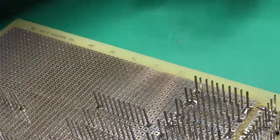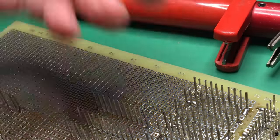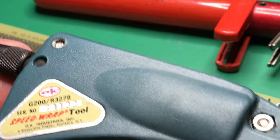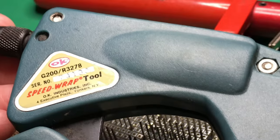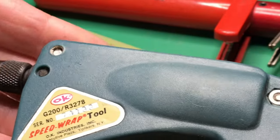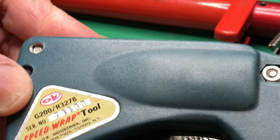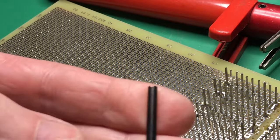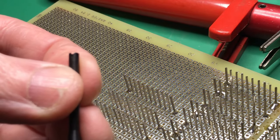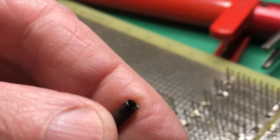There are various other types of tools used in mass production as well. This is the simplest one and the cheapest one. This is probably the next commonest. This is a semi-automatic hand tool. It's a bit like a Yankee screwdriver, spiral screwdriver. There's a spiral mechanism in the body, worm driven by teeth on the end of the handle, and it has a full length fixed sleeve, and the tool tip rotates inside if you can get the right angle to see it.